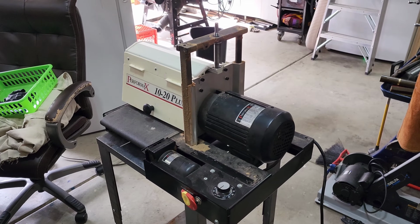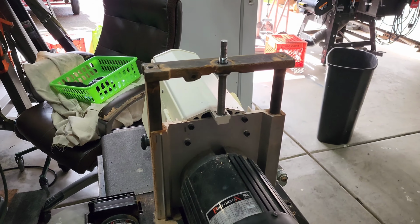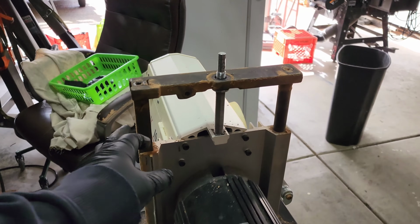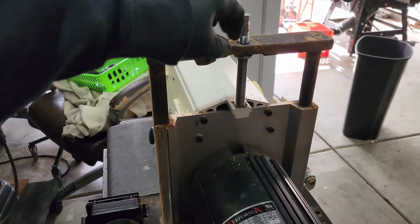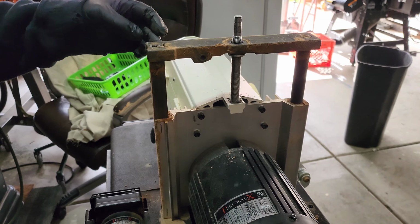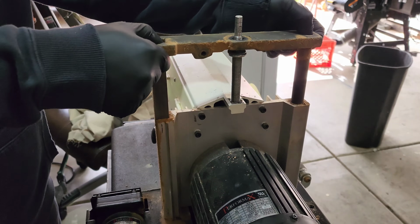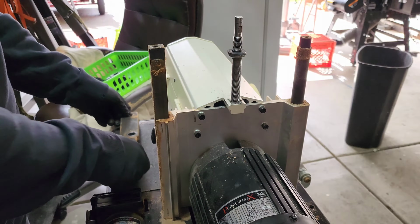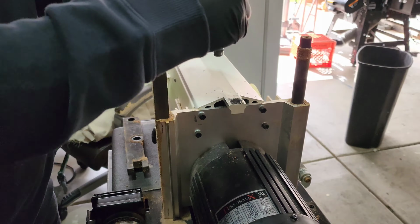Okay, I popped the cover off the back here, and this exposes the lifting mechanism. As you can see, you have your two uprights, one square, one round. Those just support this main beam up here. And they're just attached to two little grub screws in the back. So I've loosened those. We can pop this off. And then we're going to remove our elevation screw.